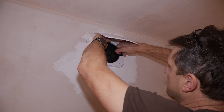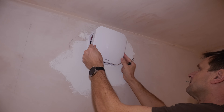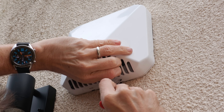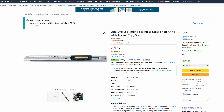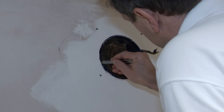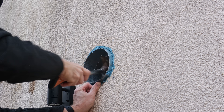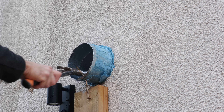So I decided to set an example and do this properly. The fan capsule is designed to be easily removable so you can clean the air filters. Four screws out and the front cover was off. With the electrics isolated, I disconnected and unscrewed the inner wall fixture part and removed it, along with part of the telescopic pipe I'd been able to slot into the metal duct. Then it was off with the outer hood and outer wall fixture part. Using an Olfa knife, I cut away the tape attaching the Intello membrane to the metal pipe, then with an old carving knife I sliced away the expanding foam between the brickwork. It was a snug fit and took quite a while, but eventually the metal duct came out with the help of a wooden block and some brute force.